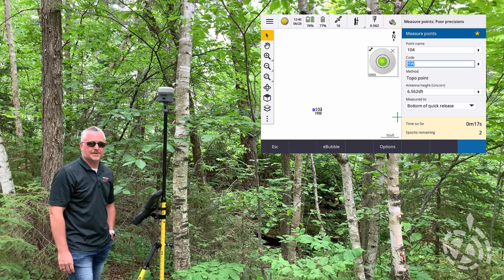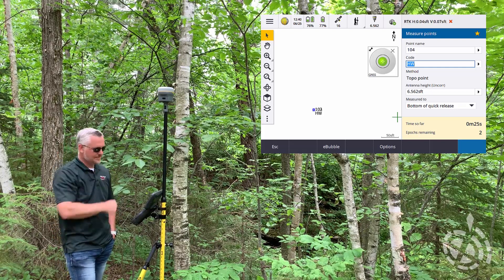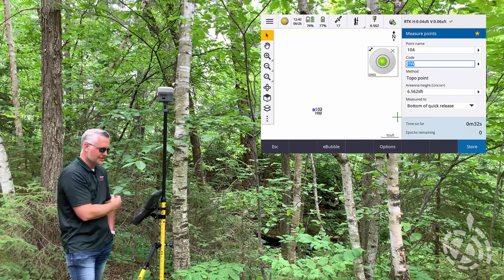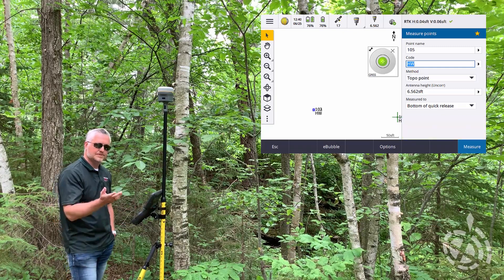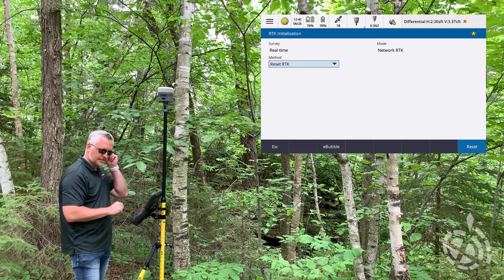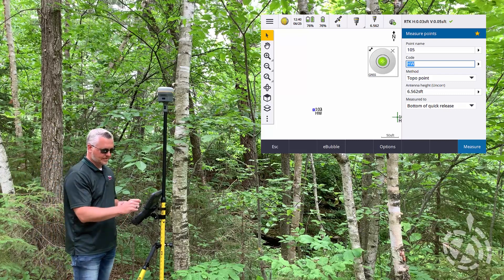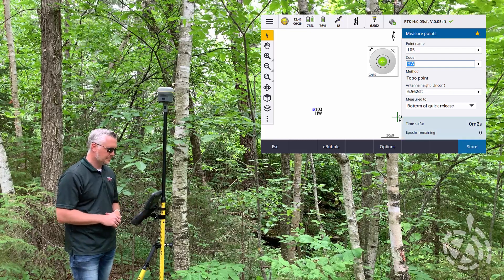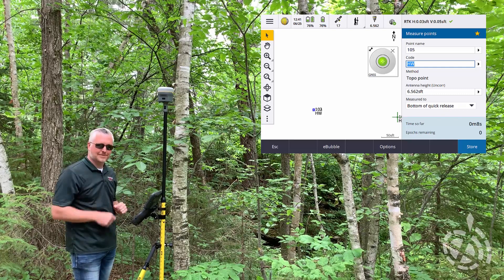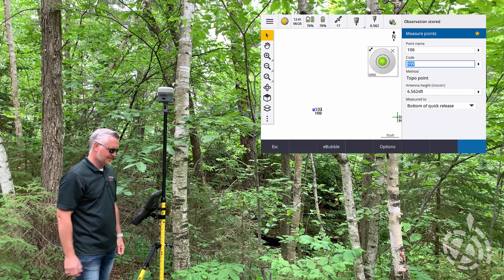The thicker I get in here, it's really got to work for those values. The TSC-7 vibrated to let me know that it was capable of storing — go ahead and grab that. Do the same thing though — do that RTK reset. Any time you're in these situations, you want to do that. Reset. You see the red X let you know it drops — you can see it jump up to two by three feet there. Then it brought them all back in, and now we're at three by five, so let's go ahead and measure that one. I'll hang out for just a minute, maybe 15 seconds — that's about all I can handle with the bugs. Store that. Observation stored.